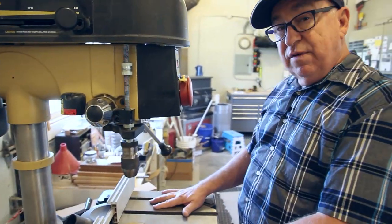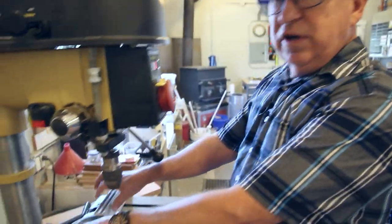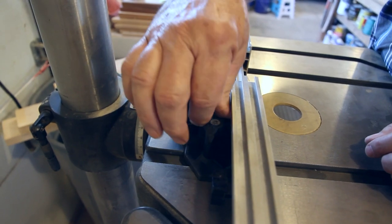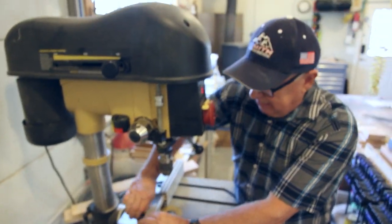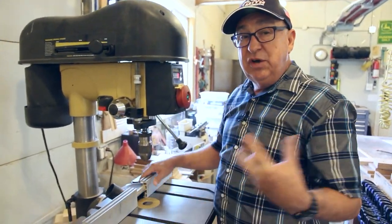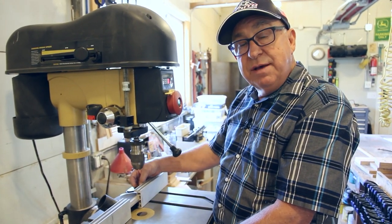What's my main complaint on this unit? It's right here on the fence. If you're working from this area and your drill press is fairly close in line with other tools, it isn't easy to get around to the back. Reaching over to loosen these nuts here is pretty clunky — you'll only get your fingers in a limited space, and then you're going to move the fence to where you want it. Then you're reaching back again working on top of the knobs, and it's just clunky. The solution — whether it's this fence or a shop-made fence — is to get those adjustment knobs up where you can access them. We're going to do that really quickly.